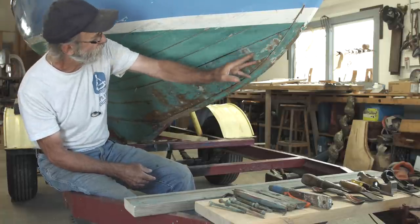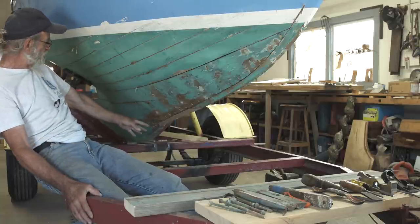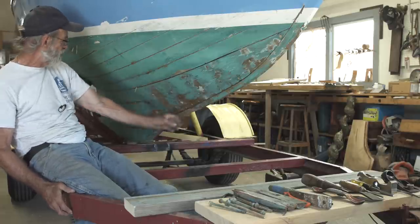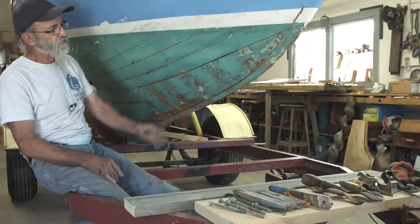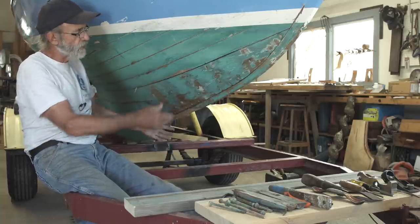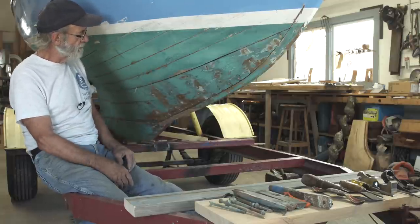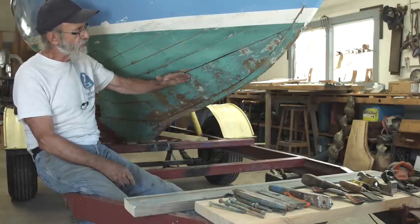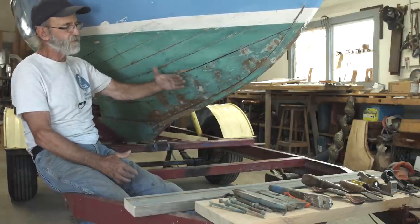I unfastened the plank all the way back to here on both sides of the garboard planks. It's got kind of an odd garboard plank in it too — you'd think the seam would just keep going, but it staggers around the first broad strake right here. So we didn't want to take the garboard all the way out; I unfastened them back quite a way, just pushed them out, peeled all the cotton out, cleaned all the rabbet out, and started trying to fit that plank back in there to find out why it wouldn't fit. The back of the plank was rounded, and yet all the surface it wanted to mate up against — the floor timber — was nice and straight.